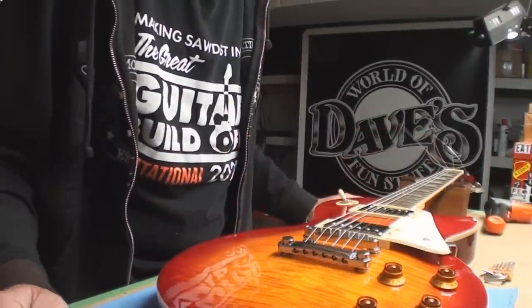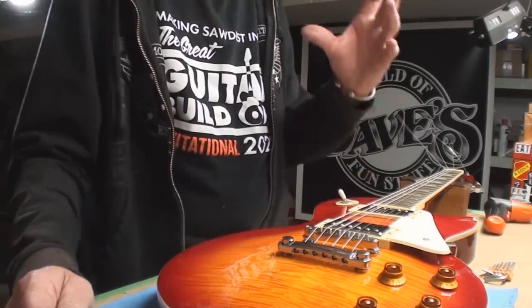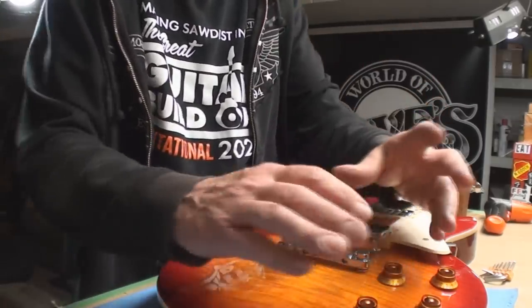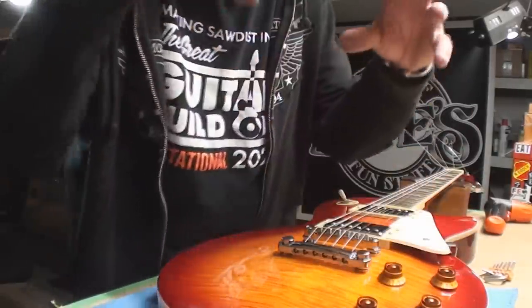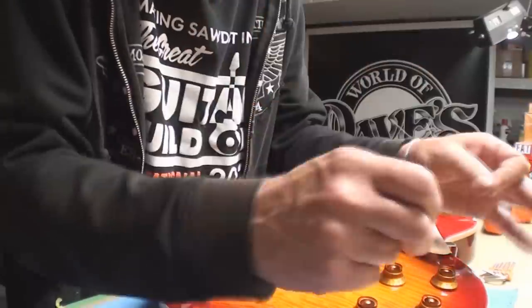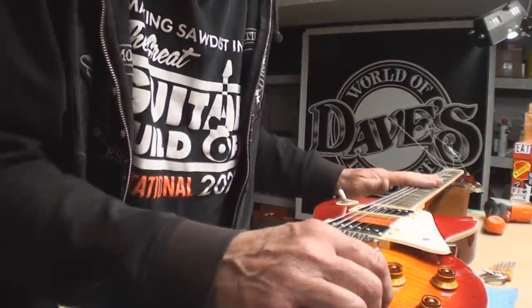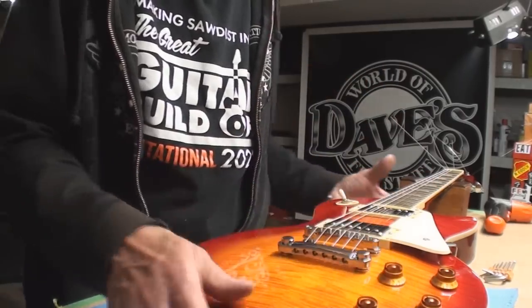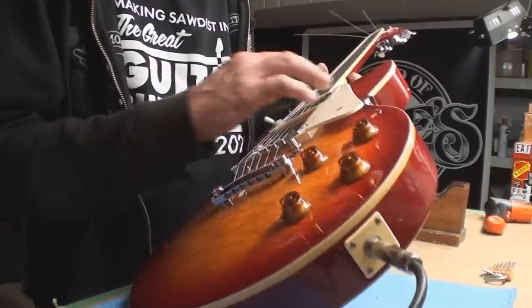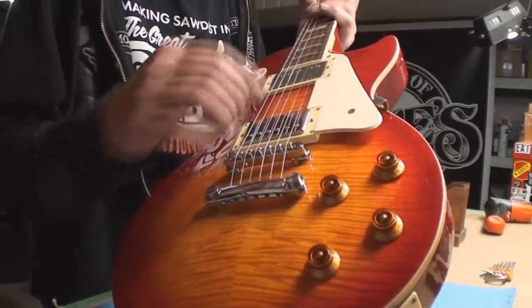As I said, I've heard bad pickups over the years — and you know when the output is seriously diminished. I walked through all the wiring with the meter, tested the switch, everything tested out — except the meter didn't show that tiny little ground fault that was enough to just kill the output of the pickup.